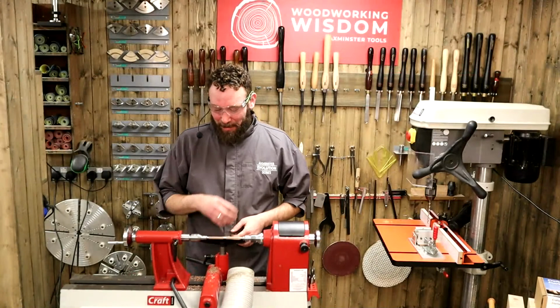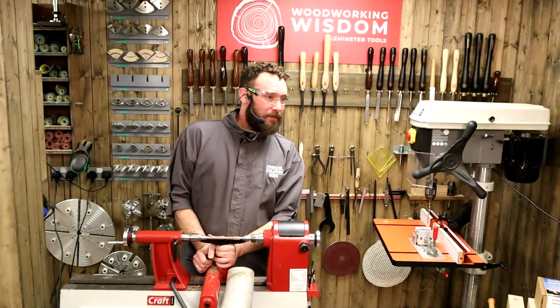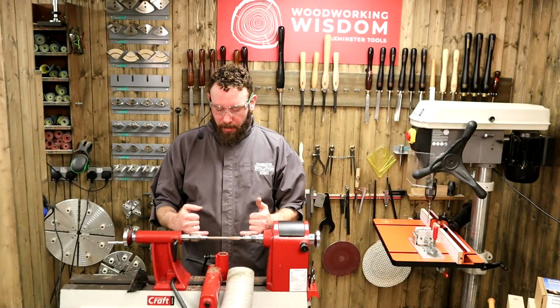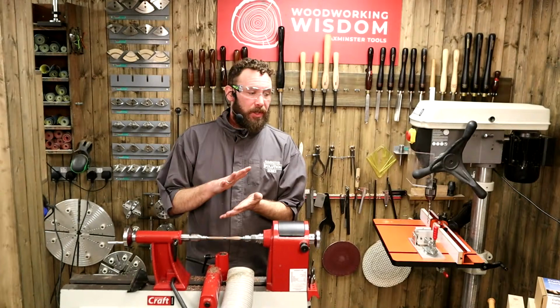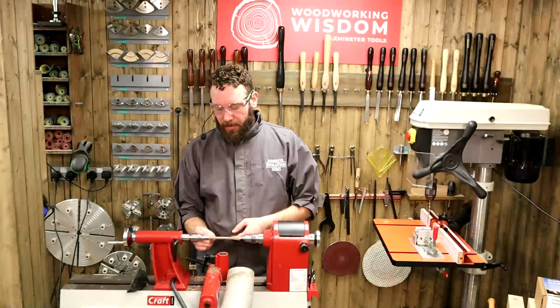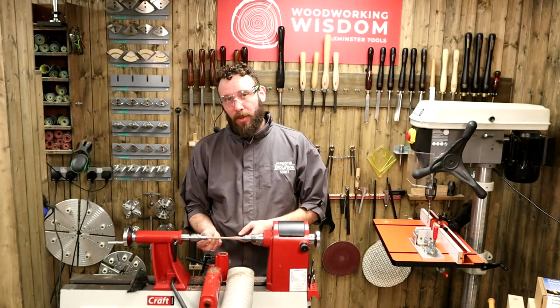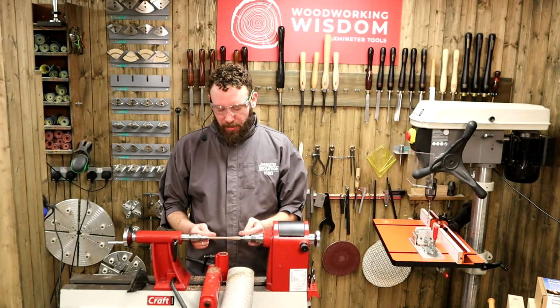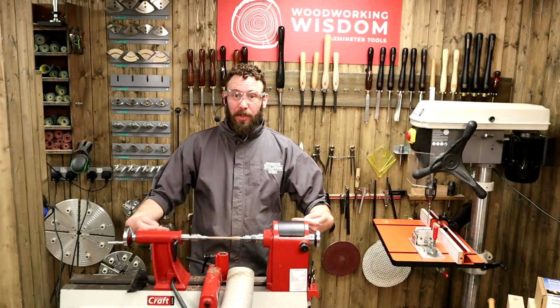Okay, so another question. Clive's asked, could it be the tension applied onto the mandrel? It shouldn't really be. That's on the brass tubes. If the material, whatever it is, acrylic, polyester, timber, hasn't been trimmed properly and there's a little overhang, sometimes when we apply pressure through these compression mandrels, that will kick up that little overhang and sometimes it will split back into the body. So make sure it's trimmed right back to that brass tube, because all the pressure on these bushings is pretty much on that brass tube. And a cylinder is a really strong shape when you're putting pressure on it that way.